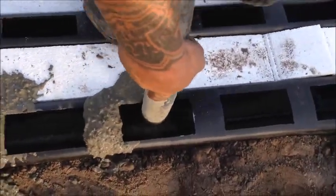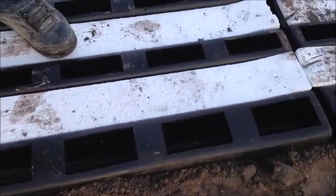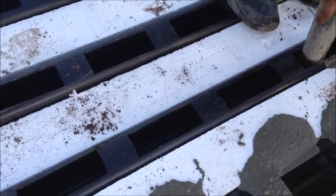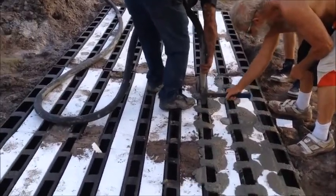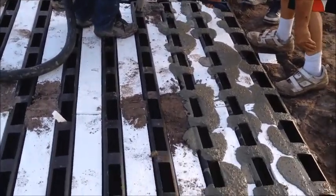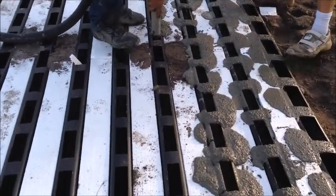See the concrete going all around the steel and going down in the big beams in the middle. You're going to get a little overspill but it won't matter — we can put it back in. We'll do one cattle guard at a time. Notice he's going down each edge, not filling it completely the first time, so it's distributed all over, just like when you pour a concrete slab. You sometimes tap the wooden forms — these are the actual beams the tractor will go over.